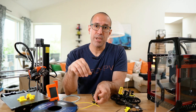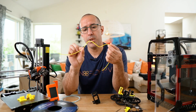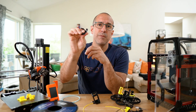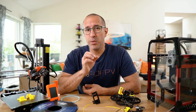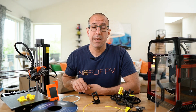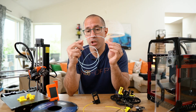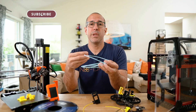TPU is a special kind of plastic because it's pretty flexible. As you can see, TPU can just bend all over, and when you have a part printed in TPU it's super flexible and super resistant to crashes — it works very well on drones because we know that drones are going to be crashing all the time. Compare that to PLA, which is much harder; it comes back to its original form rather than bending.